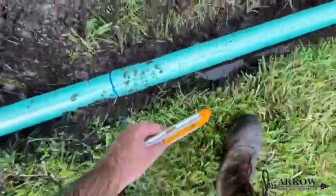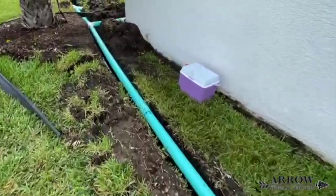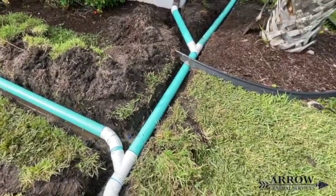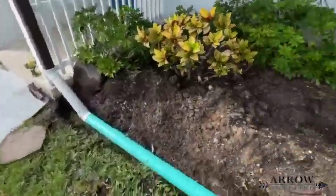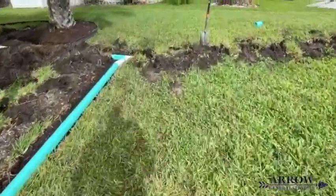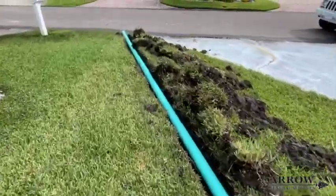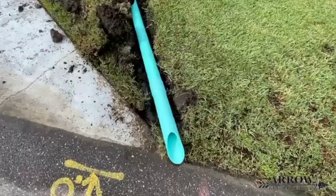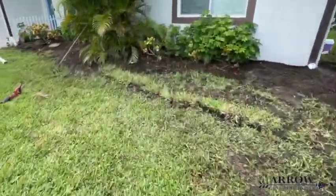The reason we connected our system into the aluminum gutter elbows is because we were trying to gain as much fall as we could — this is a very flat yard. We really didn't want to use a percolation tee on the four gutter downspouts all going into one system, because of the high groundwater levels being close to the beach. So we wanted to daylight the pipe with a straight end for this whole run on this one side of the home. Now, it looks a little tacky having the pipe connect in like that, but to fix it you just add a few extra bags of mulch and re-landscape to make the beds a little higher. We use no-float cypress mulch down here — it can't float away, and bugs and termites don't like it. That mulch will cover over the pipe and make the aesthetics look better.